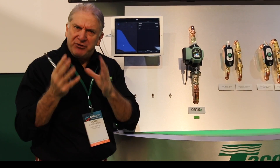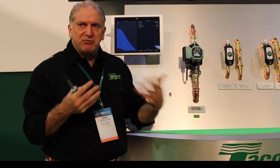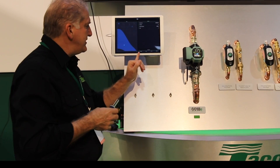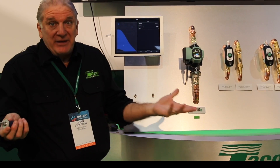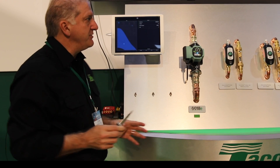So I don't have to guess anymore. If I know the flow rate for a zone pump — and I don't really need to know the head, I just need to know the flow rate — if I know the flow rate is three gallons a minute for a 30,000 BTU zone, I just turn this thing down until I see three gallons a minute. It will give me the head loss differential, and it will do the pumping I need for that zone.